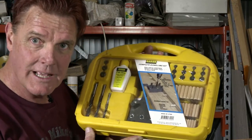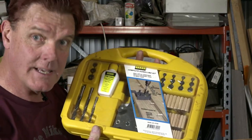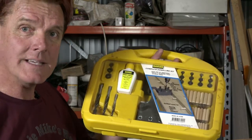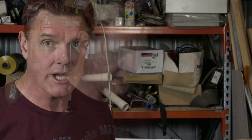The next step up from butt joints is to reinforce the strength with dowels. This inexpensive kit includes guides, the dowel bits, and a small supply of dowels — though you'll need to buy more. There are instructions in there to learn how to use it. You could also use a biscuit jointer, but that's another piece of equipment. Another method is a rebate joint, but if you've got the equipment to do a rebate, I'd suggest sticking to box joints — much stronger.